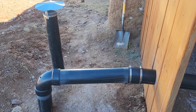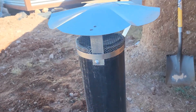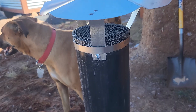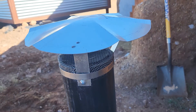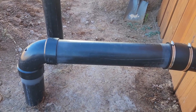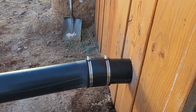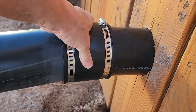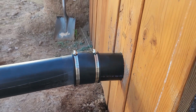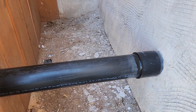This is the finished product. We bought this cap and modified it — if you check it out at a big box store or hardware store, you'll notice it's a little different. We added screen material underneath. That's the intake — that's where the outside air will be drawn in. This other one is what's going into the house. We didn't quite line up with where we ended up in the trench, so Dawn put on a flexible coupler here secured on these two pipes — it's very secure, no leaks. On the inside, we are connected through that wood and through the wall that goes into the house.